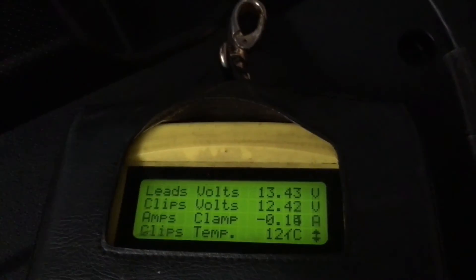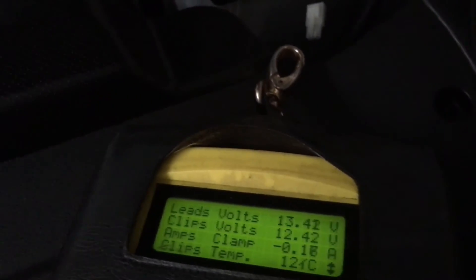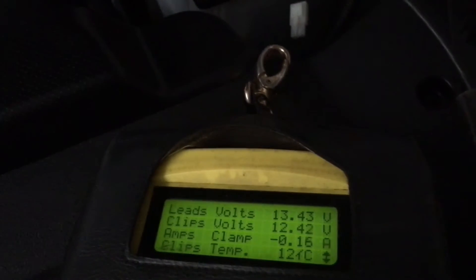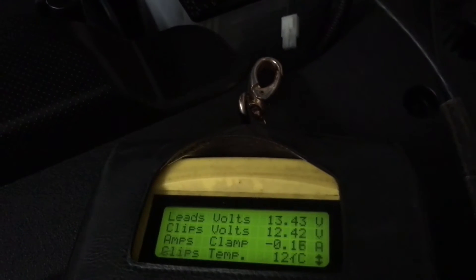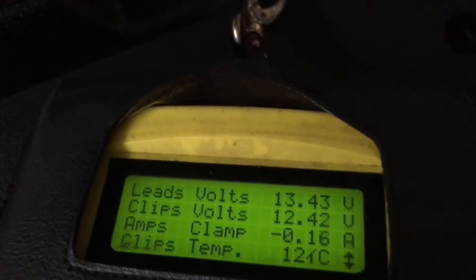We need to use a cheaper regulator connected direct to this battery to get it charged up, because there's no manual button to connect the two. When the engine's running it only gives about 13-point-something, and it goes up to 14 for a short while but then drops down to about mid-13s, which I'm not excited about. That's not really getting the right charge into the battery.